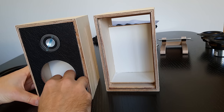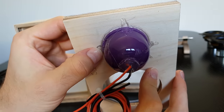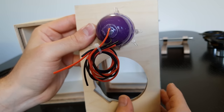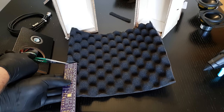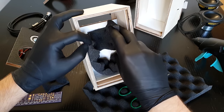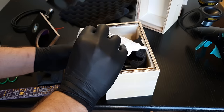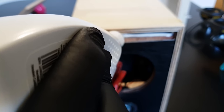Now the cabinets have cured and we are ready for the final steps. Because of the air pressure considerations, the sensitive tweeters have protective plastic domes — and I'm not saying it's a yogurt tub, it has adequately thick walls, but is that hot glue? The silicone cables at least are very nice and will last forever. Next, we cut egg-crate foam according to the manual; that serves as stuffing to prevent internal reflections. Hot glue is already present, so no shame there. Don't block the hole in the woofer magnet, and keep the remaining foam for the rear cavities. Then dispense wood glue generously for the front panels and add a little extra to reinforce the critical seal on the transmission line port.